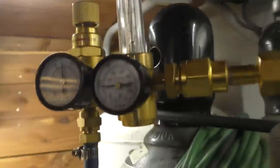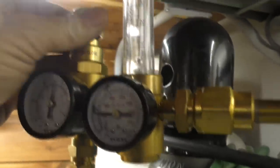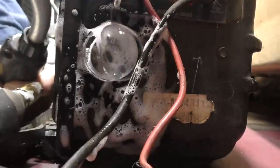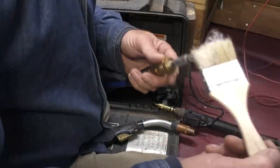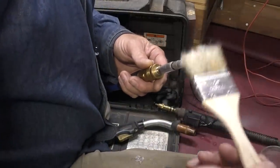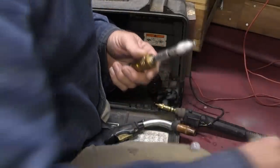That's even stranger than I thought. Even with the regulator wide open, it's flowing gas — but just a little bit of gas. You would get a lot of bubbles; that is what it should be flowing. So I think there's a problem with the solenoid. Maybe it's just a cracked hose.